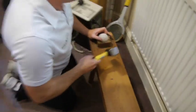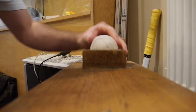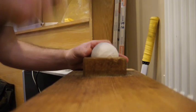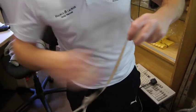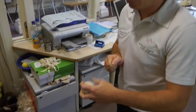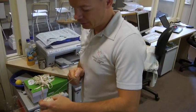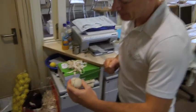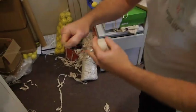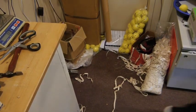Back over to the horse. Once I do it with a big hammer it tends to leave flat spots, so try not to go over the same bit again and again. Same as the inside — we're trying to start off by halving the ball. I'll just give that a bit of a quick knock to make sure it stays round.